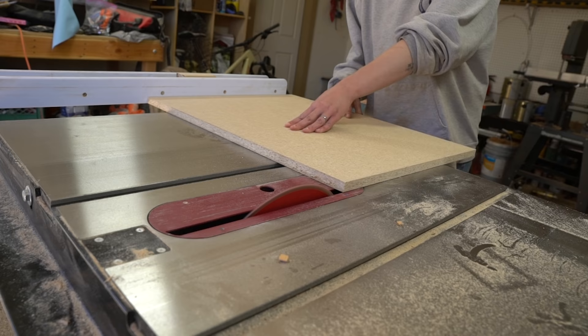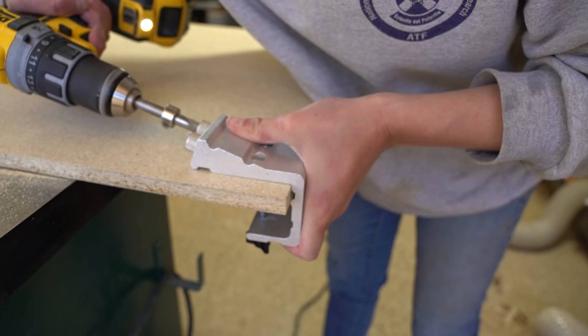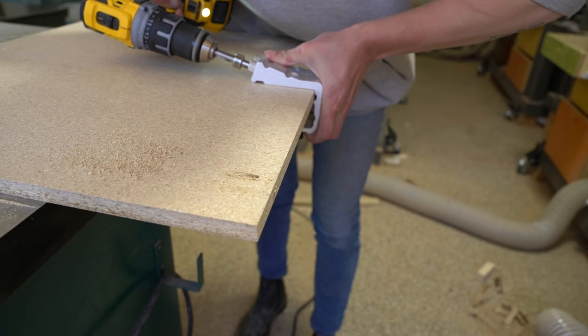With the cabinet ready, I used a small sheet of MDF to create the downdraft chamber, cutting a 10 degree bevel on the front and back edges to create a slope when screwed into the side panels of the cabinet. I again used pocket holes to place it.